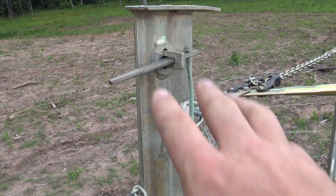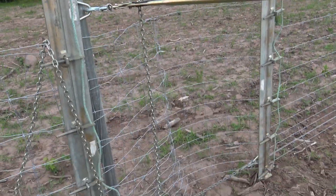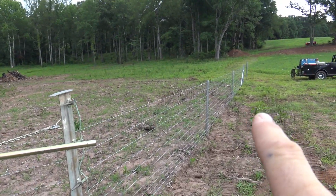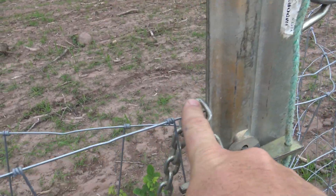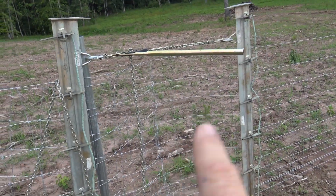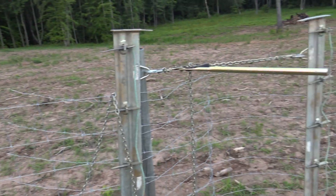So if you haven't seen this before, these are called strainer boards — there's two of them right here. This is the gut strain where they're pulled together with chain tension. If we're pulling from the end down here, we'd be pulling with the winch on the Evo 2 from Protech. What we have here are strainers that are driven in here to squeeze the wire without damaging it. They'll pull these two portions of wire together right here. This run right here is a full quarter-mile run.